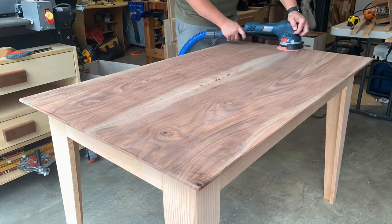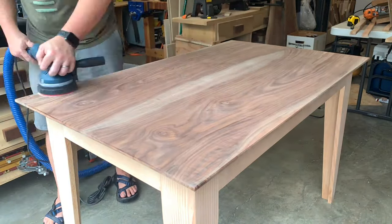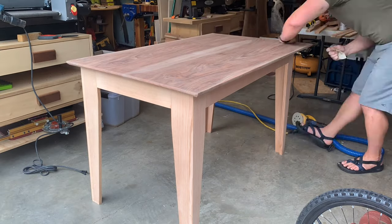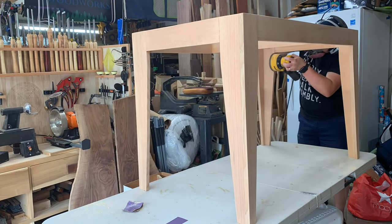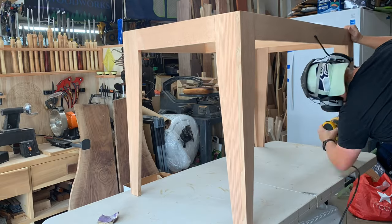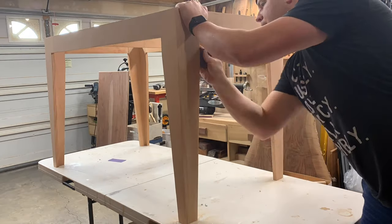Now the actual sanding progression. With any piece, sanding is the most important - it's really going to help with your overall feel and the finish. Work your way up through the grits. I started with 80, worked my way up to 220 - whatever your normal sanding progression is, just go with that. Try not to skip the grits and get it nice and silky smooth. Then hand sanding - with the chamfers, especially that top chamfer, I recommend just doing hand sanding. If you use the power sander it might be a little too aggressive. Here I'm just cleaning up any extra marks I had, any glue squeeze-out on the base. No one loves sanding, but it really is important and it pays off in the end. Sand your base, sand your top, get it all right where you want to be.